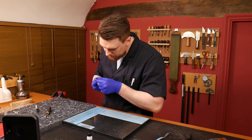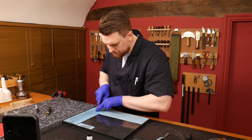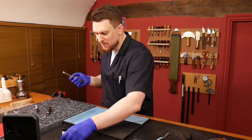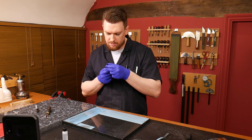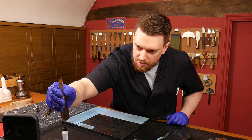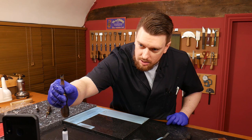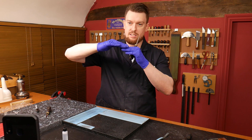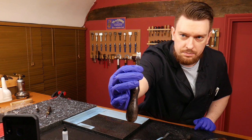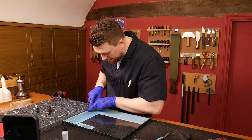Interesting — this isn't flat, this isn't level. And this is one of the reasons why I've never bought a knife or something that I didn't finish off myself, because these kind of things you only find out when you do it yourself. You can see in the center — on the sides it's wearing away, but in the center the marker pen is still there. That's because it's very slightly warped, or more like this: the sides are hitting but the center is not. So we'll see if we can get it done on 2500 grit, which isn't really good at material removal.